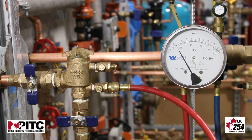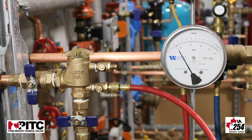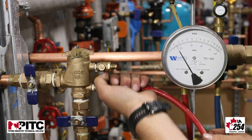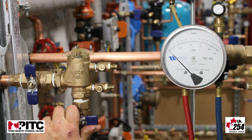We have a minimum spring on our check valve of 1 psi, so our gauge must hold above 1 psi constant for two minutes. Right now our gauge is holding at 2.4 psi, so this would be recorded as a pass as long as it held constant for two minutes. We're then going to close our test cocks, remove our high hose, and return our device to service.